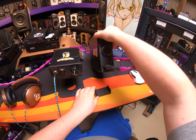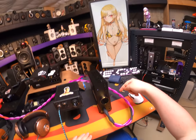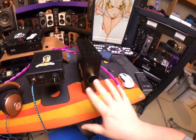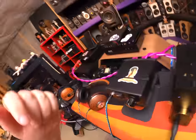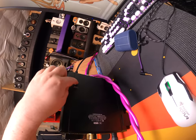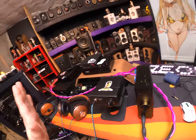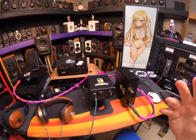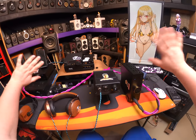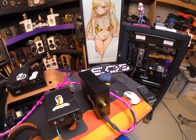It comes with five feet. You could put four feet on the bottom, or four feet on the bottom and a fifth foot on the side so you could stand it upright. You'd obviously want it in that orientation so the wires are low, switches are high, and the USB-C input stays on top and accessible. There's also a rubberized voltage switch — check that before plugging in, as it shipped to me set to 220 volts. There's a big piece of paper in the box with both amps — I think it might be set to 220, since they sell more overseas. Double-check before you plug it in.